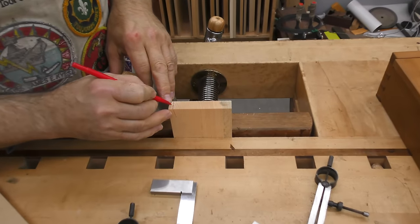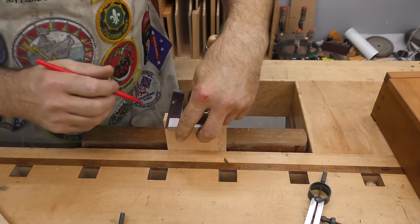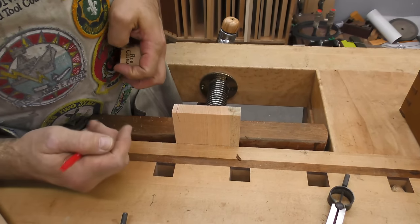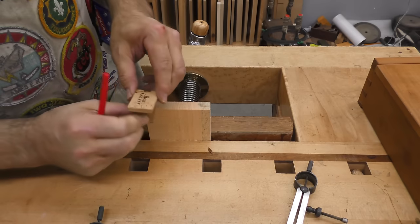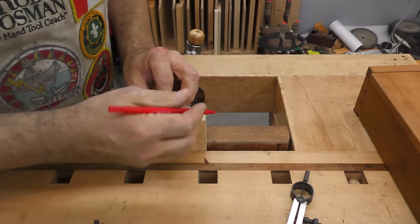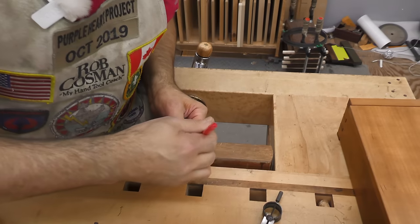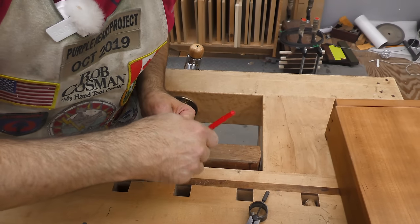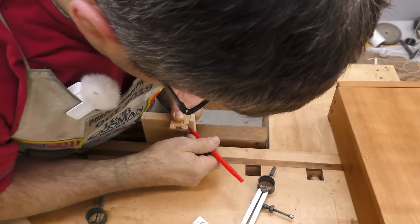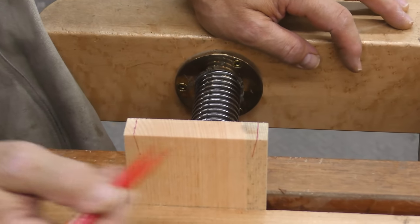The line across the end must be square with no exceptions - this is the make or break of the joint. That has got to be a square line. We've got our 1:6 slope. In order to do the other side with the same marker, the reason why it's shaped like a T - I spin it like this, put my pen in the hole, move the gauge over to it. Make sure you have a good easy-to-see line, find your gauge mark and come up. So now we have the two outside half-pins.